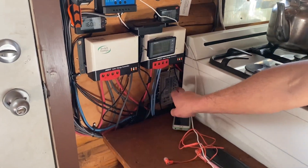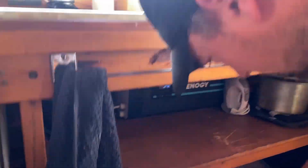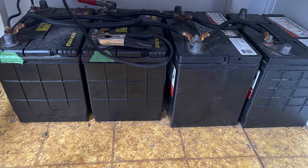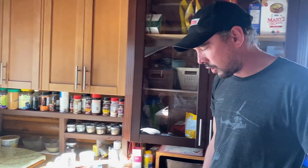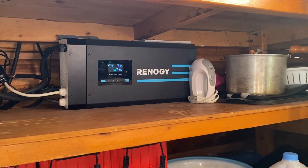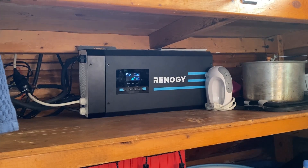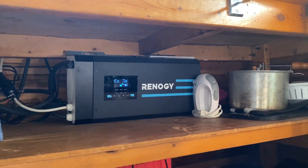Since a lot of things are 12-volt, I have everything fused into a 12-volt block so everything's isolated, with a main 40-amp fuse. The batteries we have now are three 220-amp-hour 12-volt deep cycle batteries, upgraded from five 80-amp-hour batteries which were questionable. Then we have our Renogy 3000-watt inverter charger, which works awesome. It's plugged into the generator and capable of a 70-amp charge, but my 2000-watt generator couldn't handle that — so I've adjusted it to a 50-amp charge.